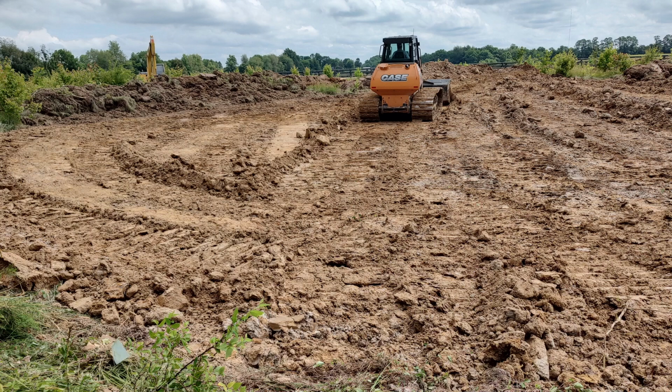John removes a large amount of soil to transform this hill with a convex shape into a wetland with a concave shape. He separates the clay and the reddish-colored sand and the darker-colored topsoil as he removes the soil to make the basin. He places and saves the clay in one long pile, we call this a windrow, and then spreads sandy soil outside of the area where the wetland's being built.